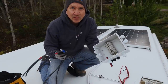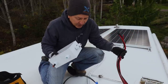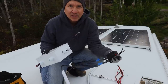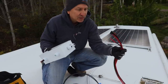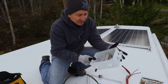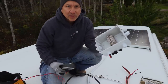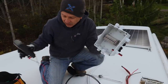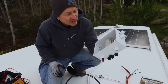Another benefit is that I can use different cable from the solar panels to this box than from the box down into the RV. This solar cable has a thick insulation — they're both 10-gauge cable, but this one is rated for outside use, standing up to UV, sun, heat, and temperature changes. The cable running down into the RV is rated for inside use and is a lot easier to work with. And once everything's set up, I can easily test things — since all solar panels terminate in this box, I can measure voltage or current on individual panels or sets of panels right here without pulling apart any MC4 connectors.